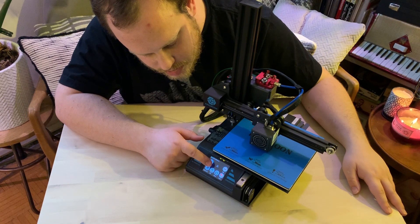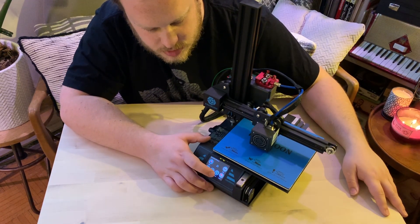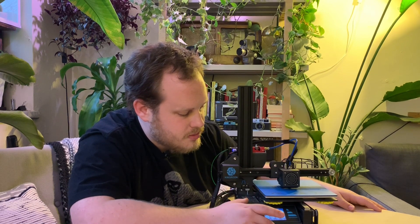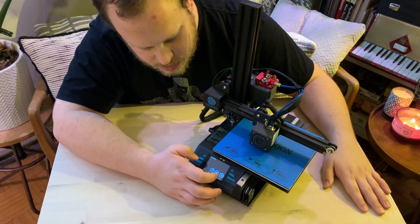You can see the temperature for the extruder is starting to heat up — it's getting to 64, 65. The extruder usually heats up pretty quick. The heated bed is something that will take a while to heat up a lot of times. The preheat option is definitely handy for the heated bed because, as I mentioned in our previous video, it has a lot of thermal mass — so it takes a while to heat up and a while to cool down. It's good to have it preheated so that you don't have to worry about that wait time. Even if it drops a little bit while you're doing setup, it still reduces your setup time substantially. I'm going to turn off everything because we don't really need to preheat anything right now.